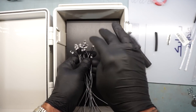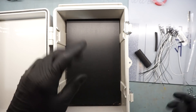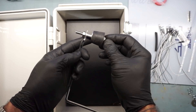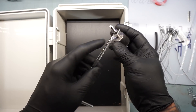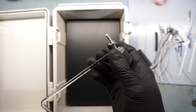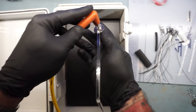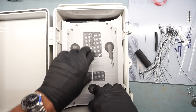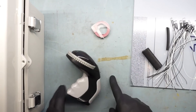I'll do about four or five LEDs per acrylic rod, with three rods total. The rods mount to a rubber bumper — I drilled a hole in it — and use a quarter-20 by two-inch bolt. I heated and bent the acrylic rod, flattened the end, drilled a hole, and it mounts nicely. Then a spark plug wire fits right onto that quarter-20 bolt. I mocked everything up in Photoshop to lay it out — boards go underneath, spark plug wires go here. And of course, no flux capacitor would be complete without a Dymo label maker with red tape.